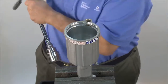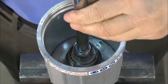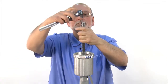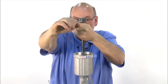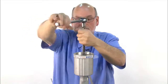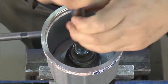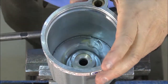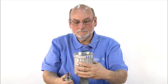Remove the gland using a 1 3/8 inch socket. You'll want to use an extension to get down inside the cylinder with a ratchet or breaker bar to loosen the gland nut. Use a ratchet to disassemble the gland, which will then remove the cylinder from the handle assembly. Once the gland is loose, it can be removed by hand.